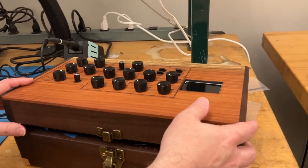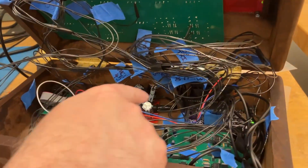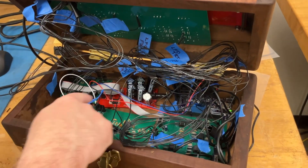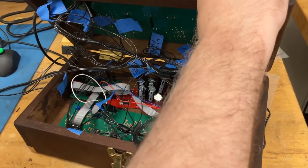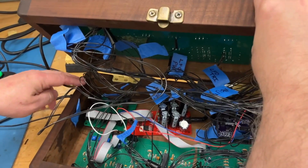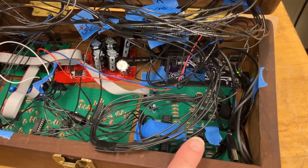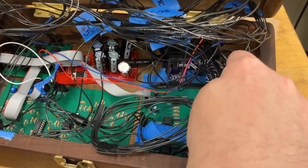Can't wait to look inside. Here's the insides: power supply, Adafruit Grand Central M4 ARM core — this is the main analog engine, which is the main thing I wanted them to get working this semester. There's the board over here with the opto-isolators for the MIDI interface, and over here is the board with the sallen-key filters that filters the PWM outputs from the microcontroller to drive most of the analog control voltages.